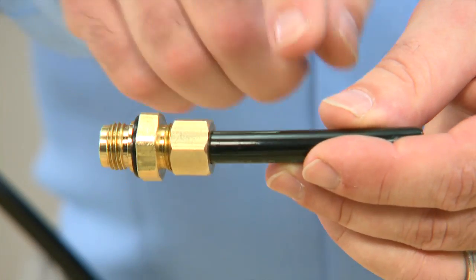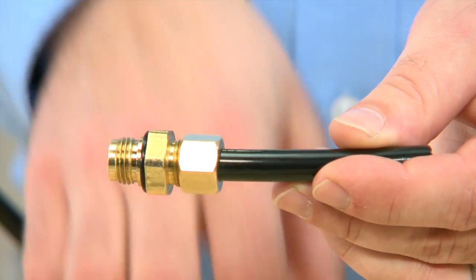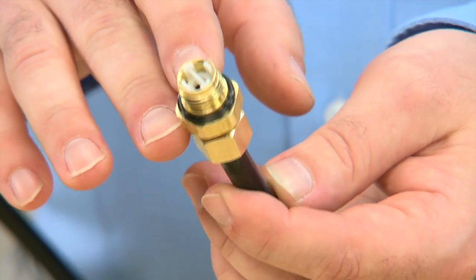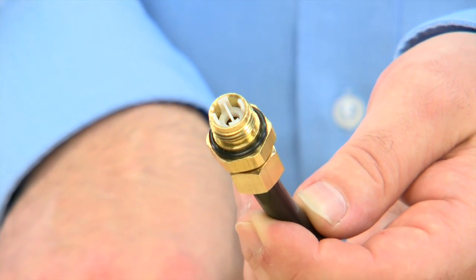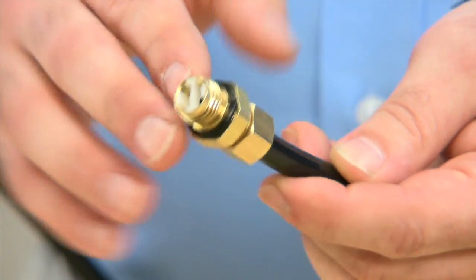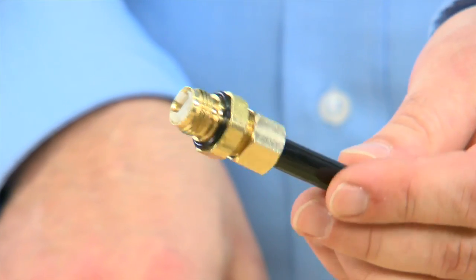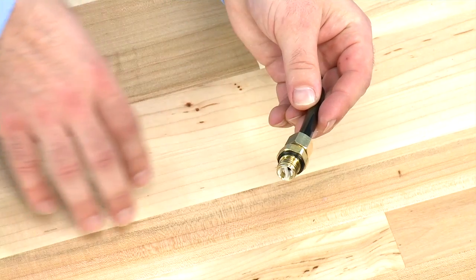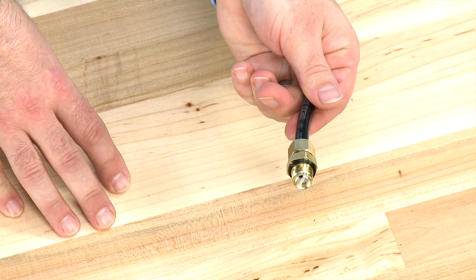There are four components: our hose, the nut, the connector that is inside the nut, and the end o-ring. This o-ring seals between the brine line flow control and the body. If there is damage to this o-ring, it will not seal properly. Any damage requires replacement of the o-ring. Make sure to use silicone lubricant when placing on a new o-ring or reinstalling this component.